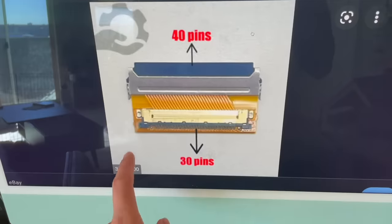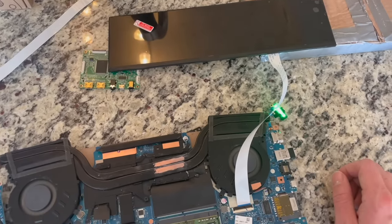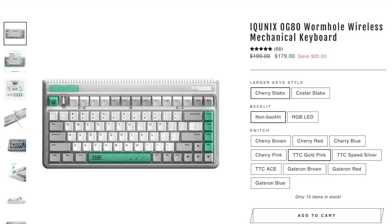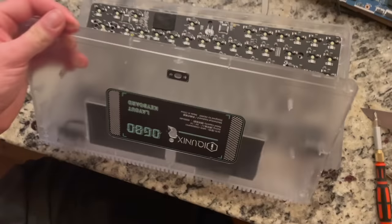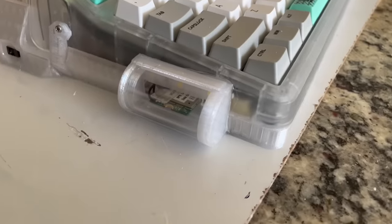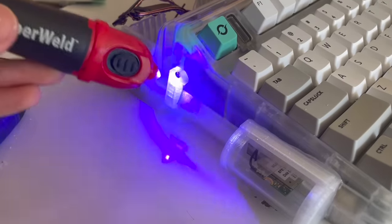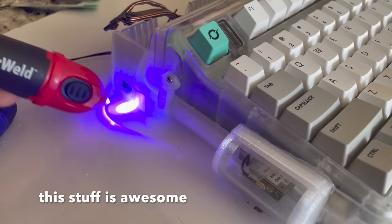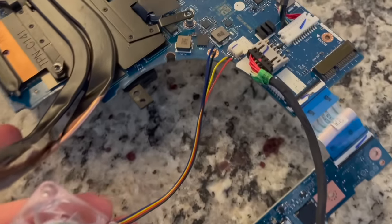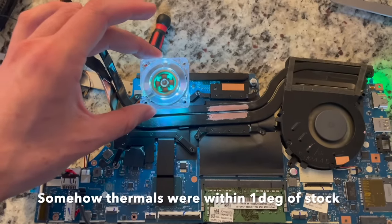I also experimented with driving non-native displays directly off of the motherboard. Unfortunately I didn't have any success with this, but my computer doesn't have a mux switch anyway, so I decided not to fret about the uglier exterior and just accept that I'll get marginally better gaming performance by using my display out. For the chassis, I used the Onyx Wormhole keyboard with the gold-pink keys — I love this thing, but it was horrible to disassemble. I 3D printed a base that lifts the whole keyboard up by about a quarter inch, giving me just enough room for the motherboard. Because both the prints and the housing were made out of translucent material, it was a perfect application for this UV-curing JB Weld adhesive, which I highly recommend. I removed the CPU fan and replaced it with a little RGB fan — never cut heat pipes. I very carefully bent the heat pipes up and out of the way so it'd fit. I also removed the left daughterboard and later thermal-epoxied a heat sink right above the CPU socket.